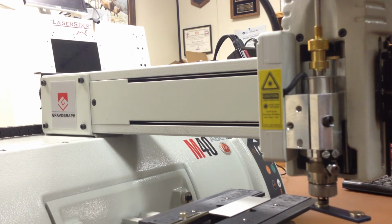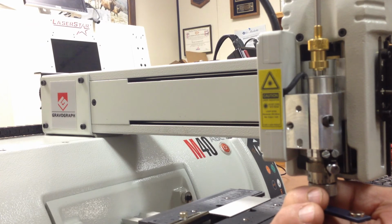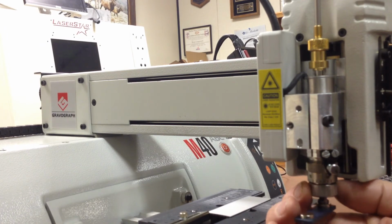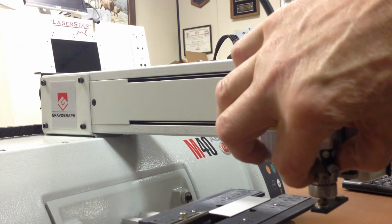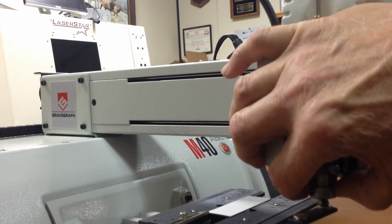Well, we have a micrometer dial right here, which is a precise measuring device. So what we do, starting at 15, we move the dial down 60 thousandths. So I'm going to come down, counting by fives. Each time I pass a number, it's 5 more. There's 5, 10, 15, 20, 25, 30, 35, 40, 45, 50, 55, 60.